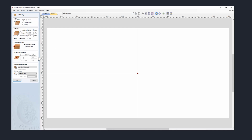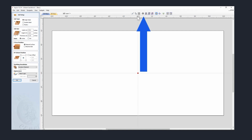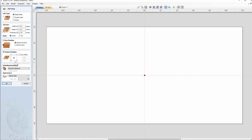The next part of the activity that we want to look at is where our XY is going to 0. To make it easy for our sign location, I like to keep everything centered when I'm designing the sign. If you look at the screen, you'll see when I'm in the center, my XY 0 is 0 here, 0 here. That's my XY datum point. If I change it to carving from the lower bottom left over in this corner, I select here, and you can see that I would zero my XY at this point. That's typically what I'll do when I cut. But for locating the sign and making the sign nice and consistent throughout, I typically like to go with the center as the XY 0 when I'm starting out. Again, that'll be changed later.